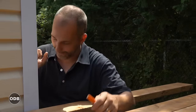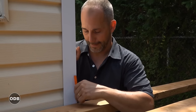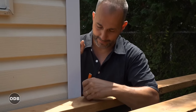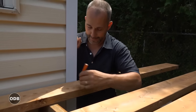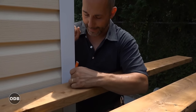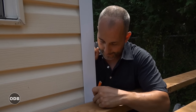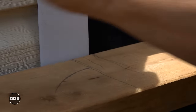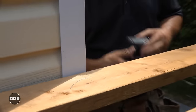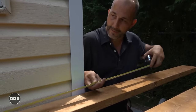Now we're going to measure for the rest of our deck. We're going to have the finished part of our deck finishing off the corner of the house. I like to have all of my decks with a picture frame outside — kind of like a nosing on a stair — so I'm going to run back about another half an inch for nosing. Because I have a ramp, I also want to have a skirt board, so there's another half inch for that. That's about the mark I want right there — whatever that turns out to be, that'll be the size of my deck. I'm using the side of the building to determine my design instead of letting my design cause problems. That's 95 and a quarter inches.